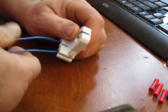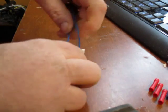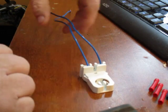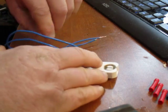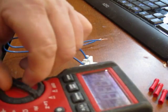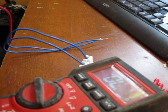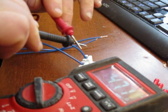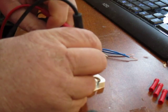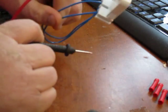The ones closest to the power cord — there are two types of these holders. One is called shunted and the other one is called non-shunted. The shunted ones have a short between the two connectors, so when you check with your meter and put the tone on, that indicates a short. So when you check these across your connectors, if there's no short, that means you can use them as an LED connector.